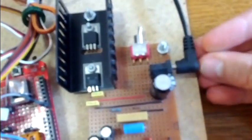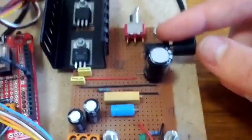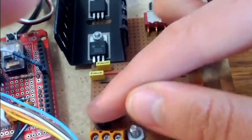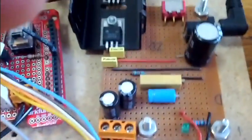The power is taken care of by this power supply module. 12 volt input, a 7805 for the 5 volts, and a 317 for the adjustable voltage to power the servos. There's a switch, an adjustment pot for the 6 volt servo voltage, 12 volts out, filter caps, an LED to tell you when it's on, and an output. Very simple.